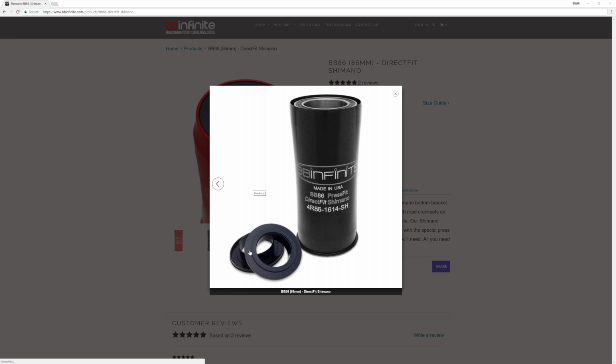and the reason they do that is because they have these plastic cups that go into their bottom brackets. Their ones are moulded rather than machined like the ones that I use. It's a design difference. In reality, will it make a big difference? No, the stiffness values are so high that it's almost arbitrary.